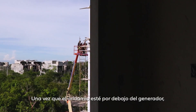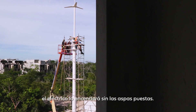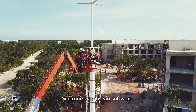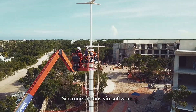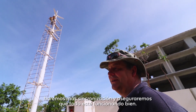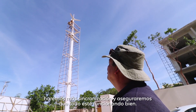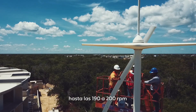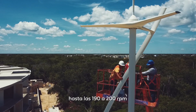When the scaffolding is below the generator, the electrician will start it with no blades on to begin with. He'll spin it, make some funny noises, do some funny movements, and then tune and tune. Tomorrow we'll put the blades on in the morning once he's happy, do more tuning, and go from a slow speed like 40 RPM all the way up to 180–200 RPM.